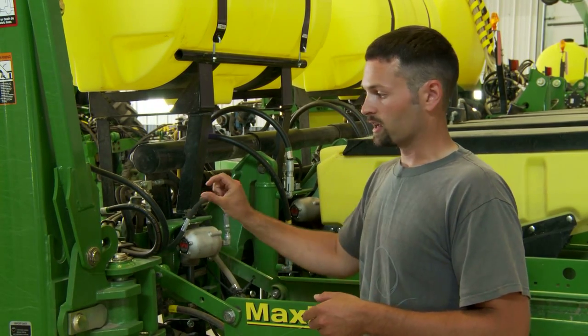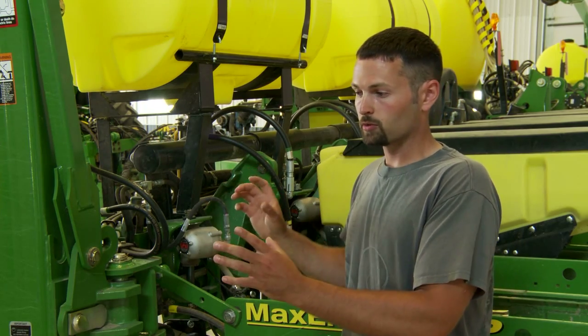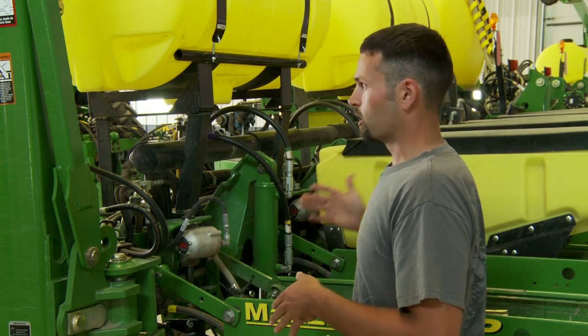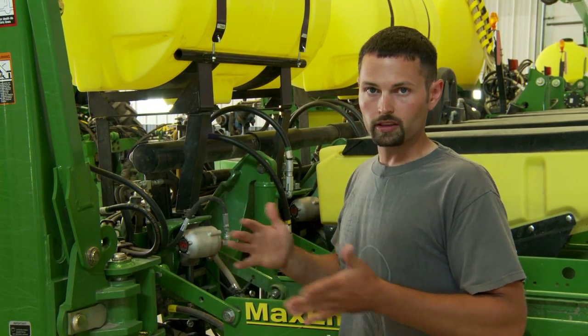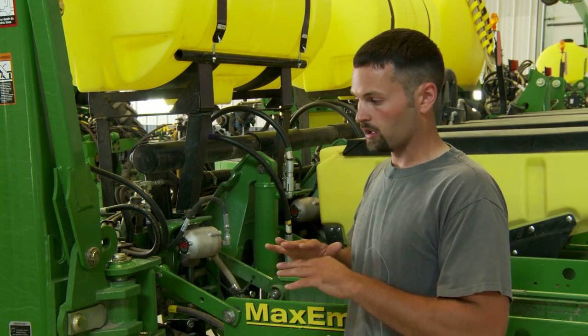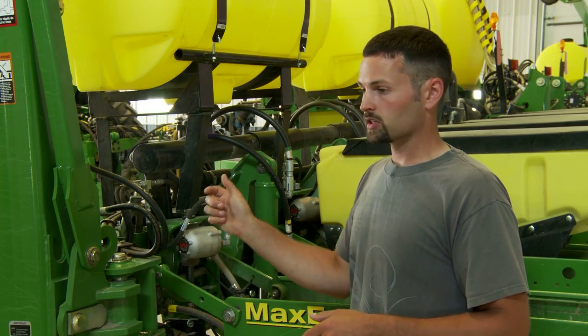This year in the cab I had a knob and I would just twist it. I used Precision's down pressure sensors on the unit, running through the 2020 into Field View on my iPad, and I can watch the margin and see what the unit is doing. I had six smart pins on a 16-row planter to give me the average and see what each one is doing. My Dawn unit was on one circuit on the planter, so I had one control over the entire planter and could adjust it on the go.